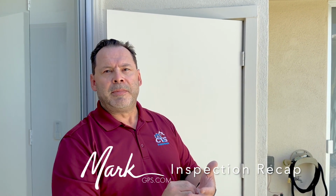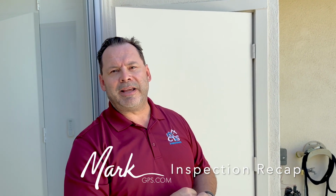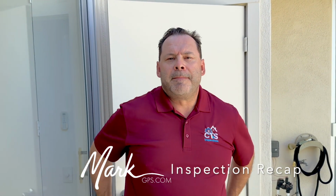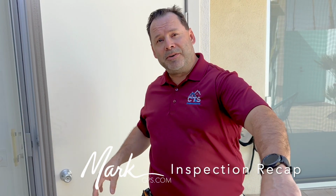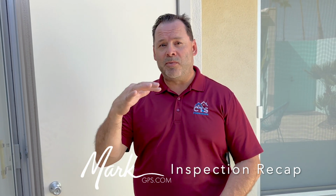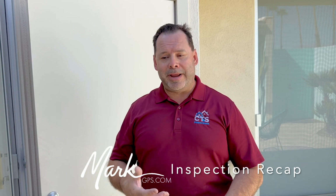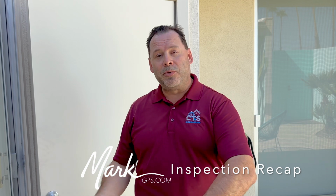Okay, so they can be adjusted in some way. Yeah, because if you shut it and think it's locked, you can just open the slider. Okay, so it's not aligning. And then water came in like we talked about over in that addition off of the bedroom. I believe that would come from the bottom, since that was a patio at some point in time, and then they extended it out and put a slider door there. That does leave a point where water can go underneath that threshold or that frame for that slider. In this case, we had a lot of standing water that didn't recede right away, and it found the path of least resistance. So that's where it came in.